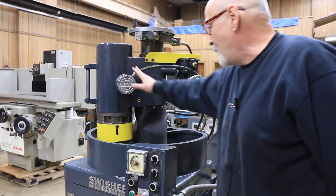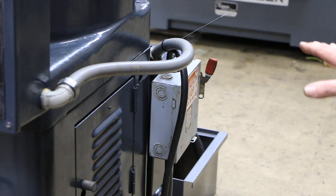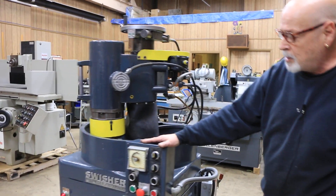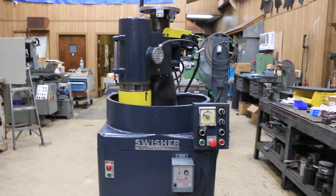The spindle is a three-phase 220-volt spindle. The rest of the machine — the hydraulic pump for the feed, the valves for the feed, the power for the timer, and all this stuff — is 110 volts, and that's also marked on the back of the machine.